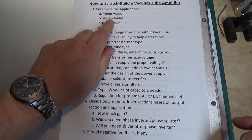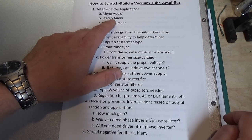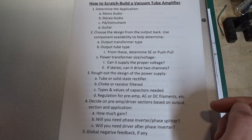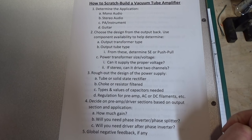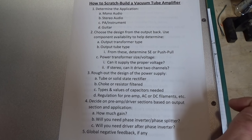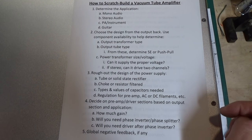The first two — mono and stereo — are designed to cover all of the audible frequency spectrum. You want them to reproduce the sound as clearly and accurately as possible to what it was like when it was recorded. A PA and instrument amplifier doesn't necessarily do that. They're designed to be very loud, to project the sound over a large area, and a lot of them are more mid-rangey — less treble and less low bass. They're designed to reduce feedback from live performances and to project the sound of vocals — whether it's speech, singing, whatever.